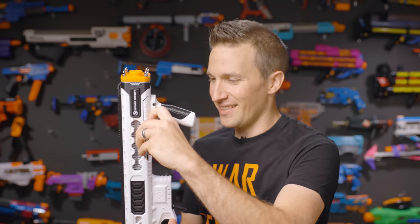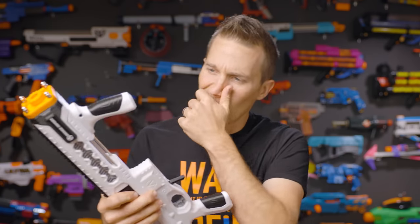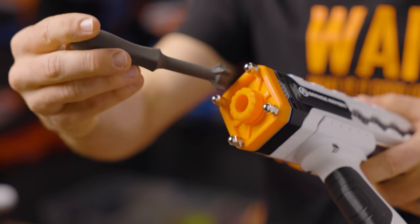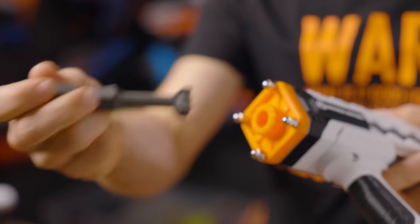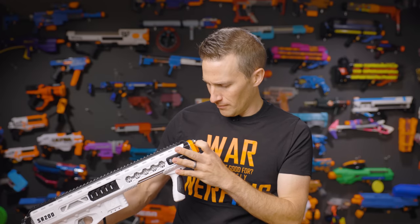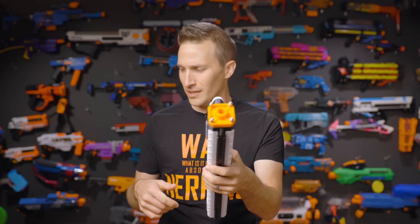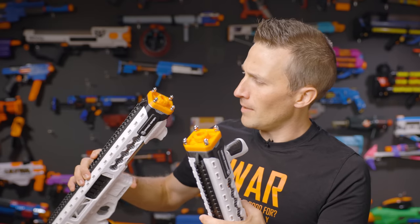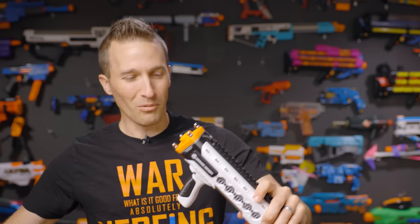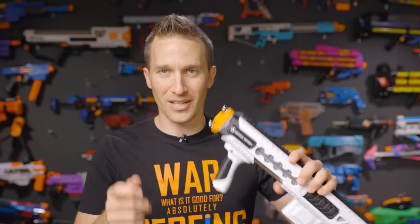I'm still bugged by this notch here — I'm going to sand these edges. If these edges were just filleted, or you had a little fill-in piece that could slot in place, that would be done. Another thing we noticed is these screws up front seem to like to loosen themselves — they were basically loose after firing one magazine. Additionally, the front plate, which I don't think is structural, has two cracks in it already, so we've already got a 3D-printed part broken on our replacement. It does sound like they would handle any replacements on parts like that, but ours did arrive broken.